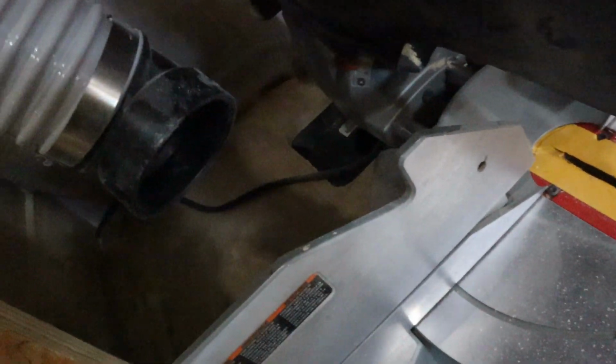In the meantime, what I've done is I have a hose connected here, which is a 3-inch hose that I can use to vacuum around. Plus I have a 4-inch port that is, I don't know if you can see this, right there, which is hooked up to my dust collector. And let's see if I can get a better shot of it. There's the port there, 4-inch port, and it runs on a blast gate at the very bottom here that I just pull. So if you have a solution on this dust collection, drop a comment below. Love to hear it. And we're good to go.